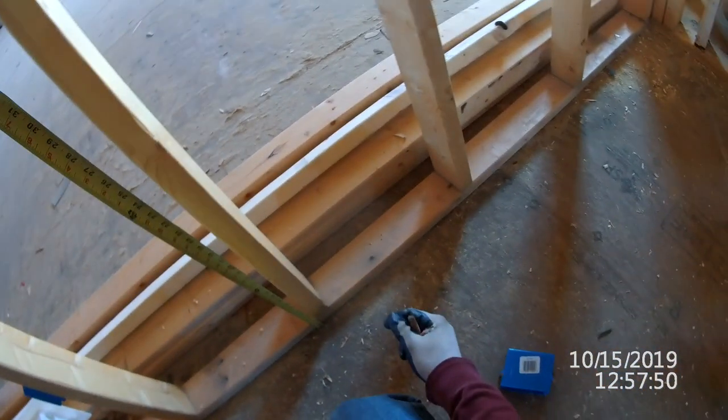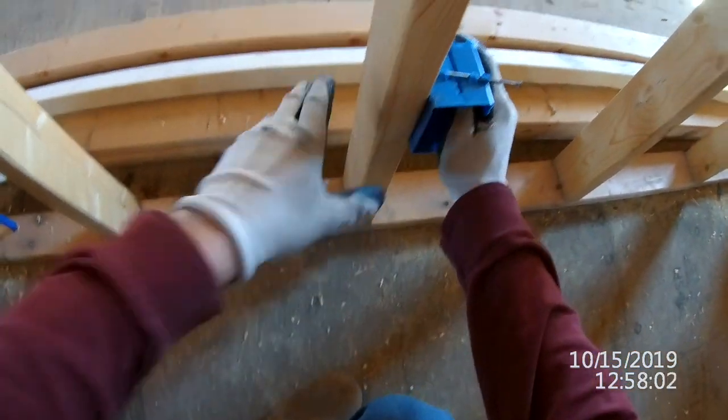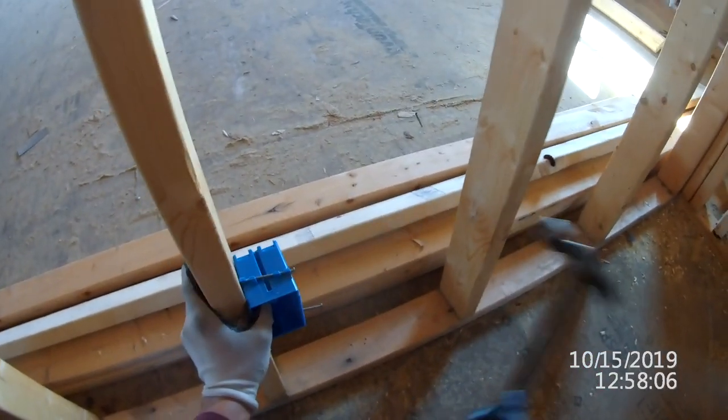When I mentioned I pull 14 off the floor, now that's to the bottom of the receptacle, as you can see me doing here. Then I just nail that sucker in — just nail top and bottom of each outlet. That's all there is to that.